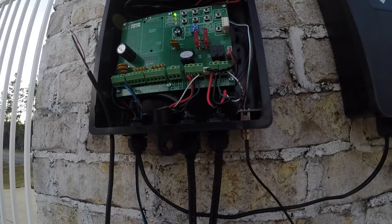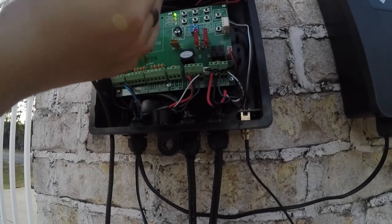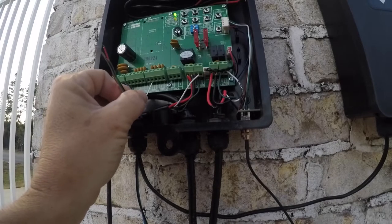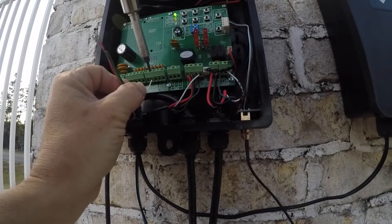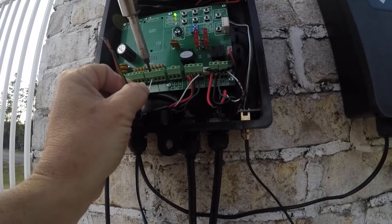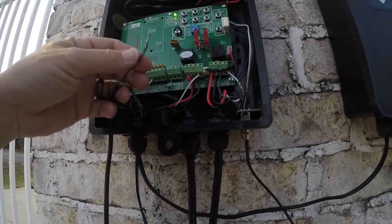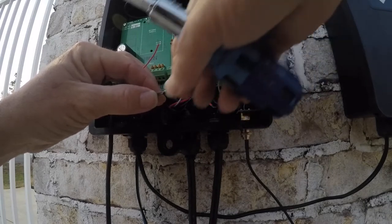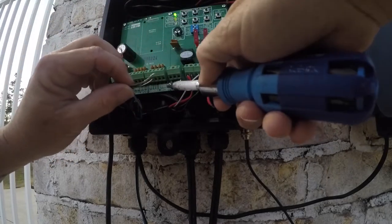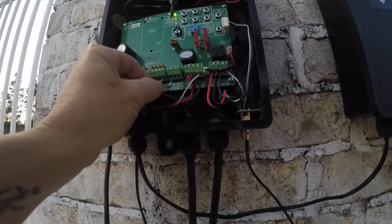All right, guys. We got the wire fed up into the box. Let's do our connections here. So it says white goes to our open connection. Let's put it in there. Okay. Green, black, and bare. They come that way from the factory, already soldered all together, and they go into the far right here, which says COM. Let's open up all the way, stick it in here.